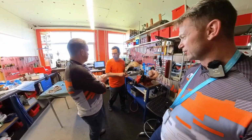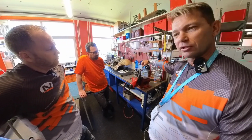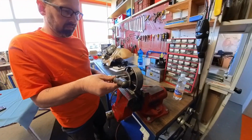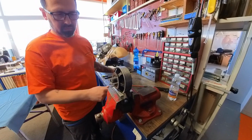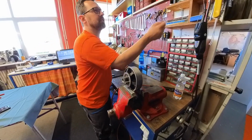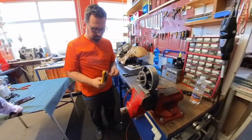The reason you don't apply the heat directly to the pin and let that go into the glue to loosen it is because it degrades the integrity of the metal of the pin. You lose temper and strength. Too hot? No, it comes down quick. It's crazy how many pins I've sent out.